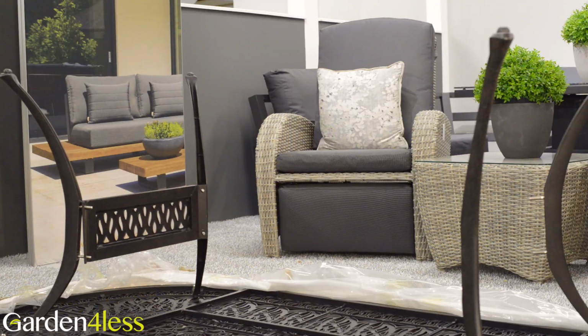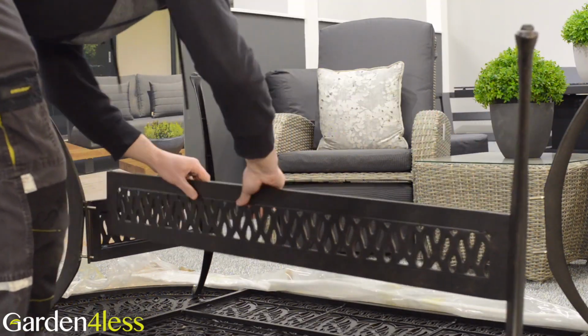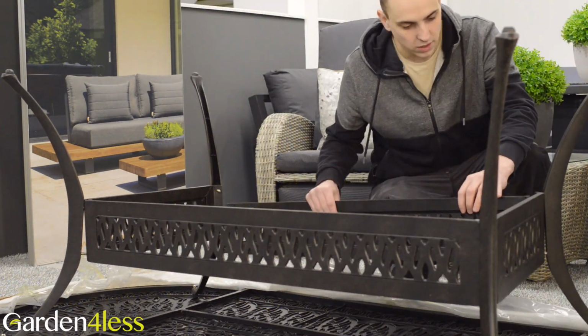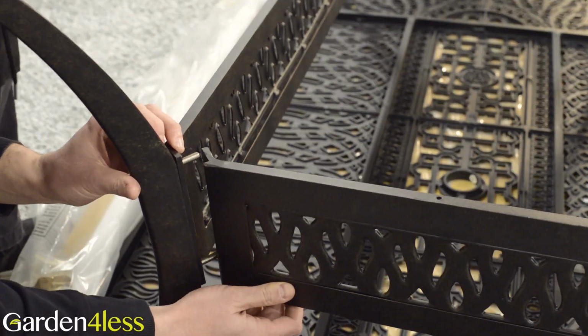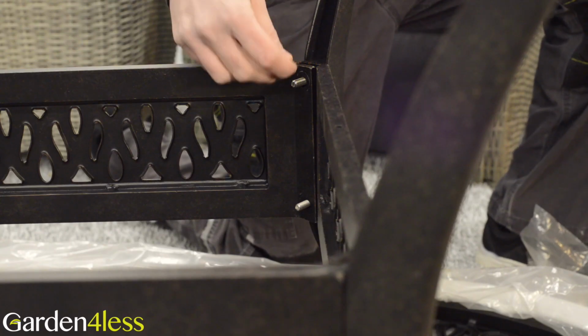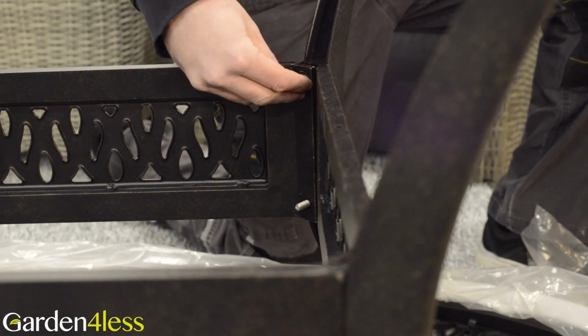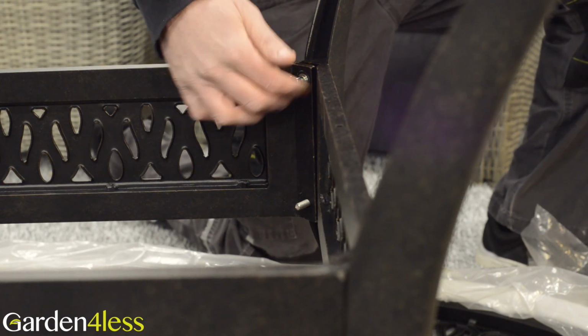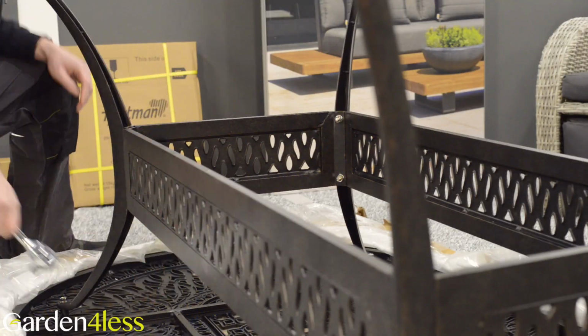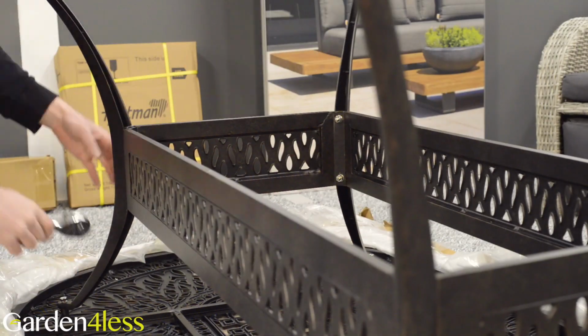Place the 4 plates onto the legs. You'll notice play in each of the legs. This allows movement for getting the plates on properly. It's important to note that the recessed end is placed on top. Screw on the flat washer, lock washer and nut to each leg bolt. Tighten the nuts on each side, then check the core nuts again as slight movement can occur.